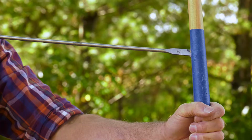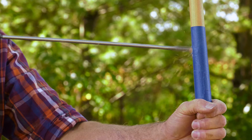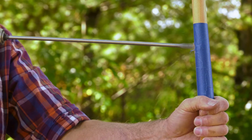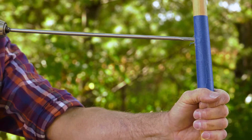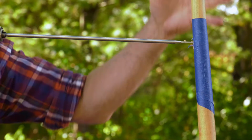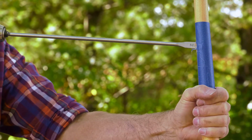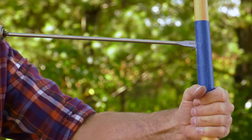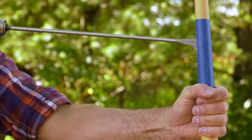This technique works. I'll get all the holes done, and then because open time on this Gorilla type glue is so long, I'll be able to ease the legs out, put the stretchers in, and then seat everything back together. The stretchers do not need glued. And the blue painter's tape prevents tear out. Ease it through and sight that bit.